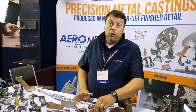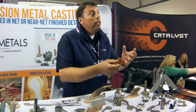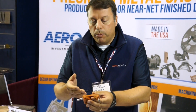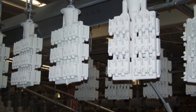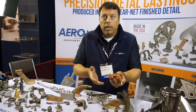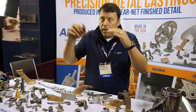The process is really quite simple. We take a mold and we inject wax into the mold, and we produce a part similar to this. We then take the wax and cover it with a ceramic slurry and make a shell. Each dipping process dries each time and we layer it about seven different layers. Then we take the wax in an autoclave and melt the wax out.